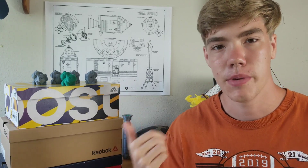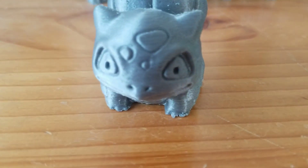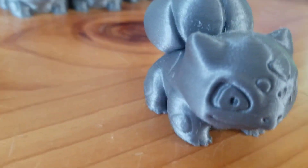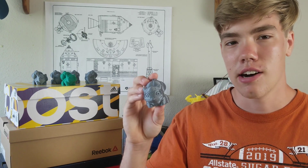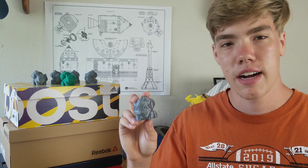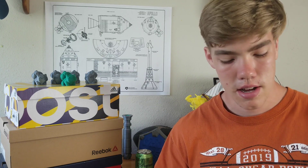The 90 millimeter per second Bulbasaur is a whole 20 millimeters per second faster than our base. As you can see in the close-up, it's pretty rough and doesn't look that great compared to our original green Bulbasaur. But overall, it's not too bad — it gets worse as we get faster. This thing took three hours and 17 minutes to finish, which is significantly faster than the green Bulbasaur, which took three hours and 40 minutes. So that's about 30 fewer minutes, but your quality is lower.